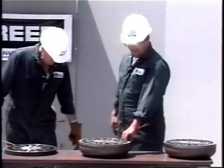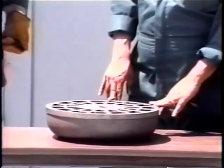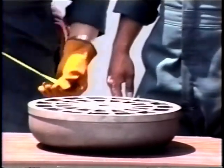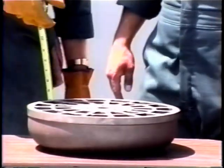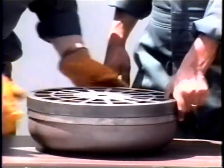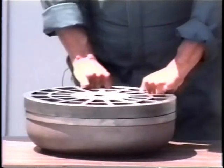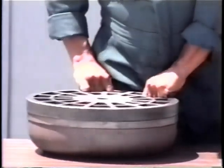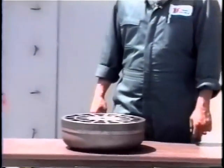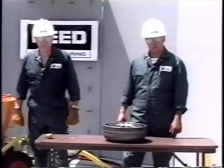Now we have the standard 15-pocket. This is the most standard series used for swimming pools, tunnels, and mining — a very wide range. Aggregate size up to half inch. The bowl is 4 inches deep, and the wear plate on top brings it up to 5 inches deep. Air consumption comes up to between 650 to 750 CFM, with outputs from 9 to 12 cubic yards per hour.